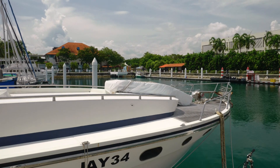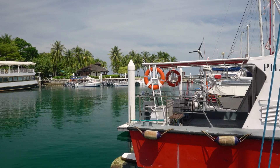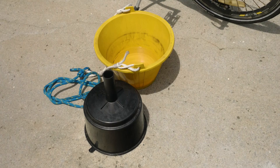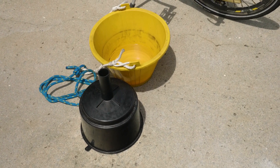The other thing worth noting is getting rid of the water in the petrol jerry cans for your outboard. This is something you should really do regularly. Invariably your jerry cans will get water in them, especially if you leave them in your dinghy and it gets rained on. Even just moisture will collect in those jerry cans. We have once actually run our outboard through water that way. So the process was simply borrowing an empty jerry can, tipping it through our double water separator filter, and then tipping it back again just to get rid of all the water. I really do recommend that.